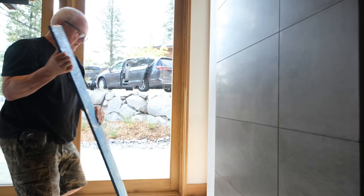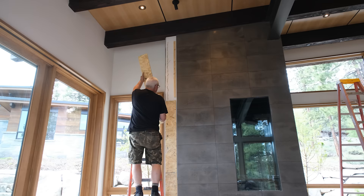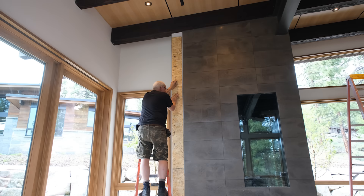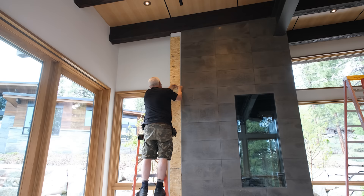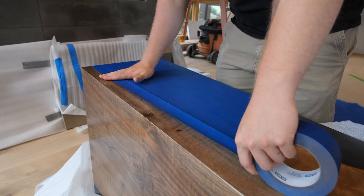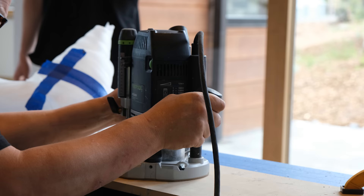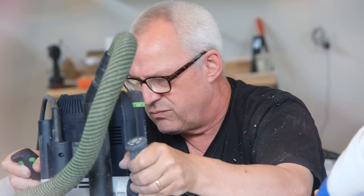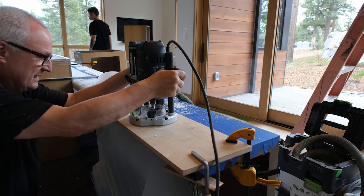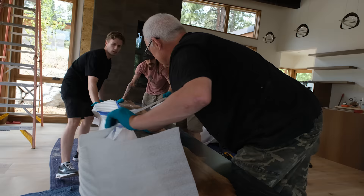While I was finishing up on the dining table, Brad kept working on prepping the wall to put our fireplace piece on. We're installing some plywood here with PL 400 to build up the thickness where the tile doesn't extend, then we're going to apply more PL 400 to the outside of those plywood pieces, stand the piece up, squish it into place, throw a couple of clamps on, and that PL 400 should hold forever. We always try to do cuts in the shop, but for the plug location we created a jig in our shop, shipped it down, routed the hole on site, and finished it right there — and fortunately it all went well.